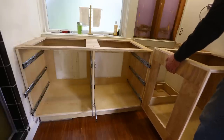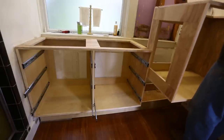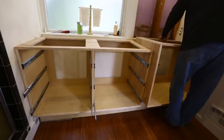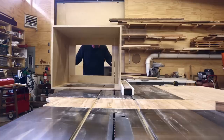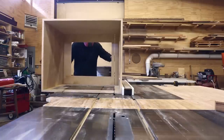On the kids' bathroom they went in just fine, but in the master bathroom I found they didn't fit. I had thought I made them half an inch narrower than the space they needed, but they ended up not fitting, which was a little frustrating. So I had to go with the nuclear option and cut one of the pieces down to size, which I hadn't actually had to do before. I put the shorter cabinet that goes under the sink on the table saw and sliced off one end.